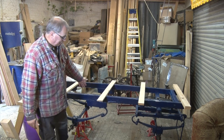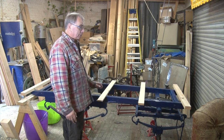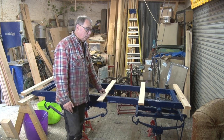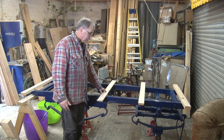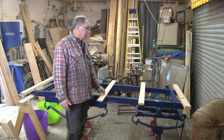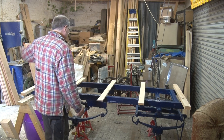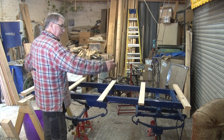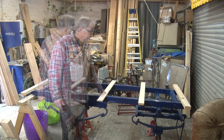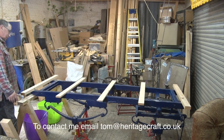And if I replace these bits, then frankly I might as well start with a new cart, because it would be faster. So the way that I'm going to deal with it is these cross pieces here are all different thicknesses. Normally they'd all be about 30mm, but they vary from 40mm to like 15mm here in the middle, which will then counteract the bow going that way. We're then putting 25mm planks on the top, which is considerably stronger than what was there before, and allows us to get away with doing this, and we'll still be able to get an overhang.